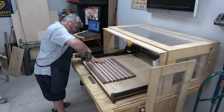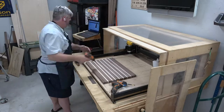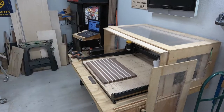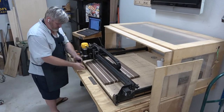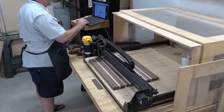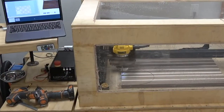I'm kind of designing this on the fly, but I think using up this scrap piece of wood is a great idea. I'll go ahead and screw it down. The X-Carve comes with a bunch of clamps to hold it down, but I really don't use those — screws are fine for me, it's what works best for me. I'll home the machine, set the carve, set the probe, slide the enclosure closed, put the front door on, and let's get to carving.